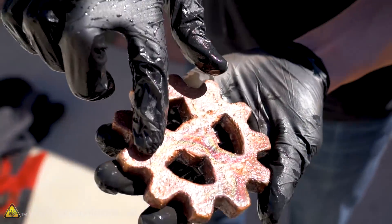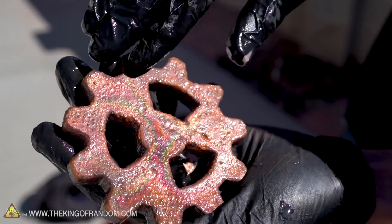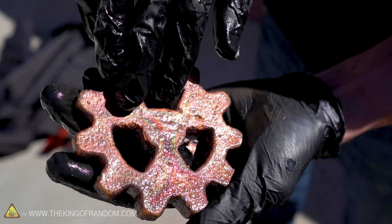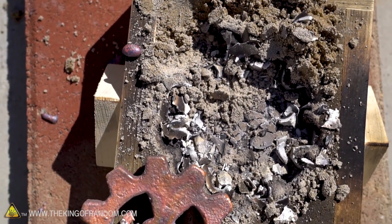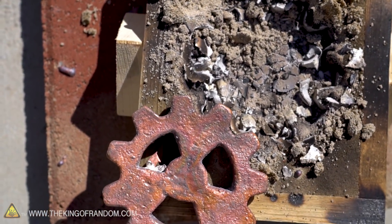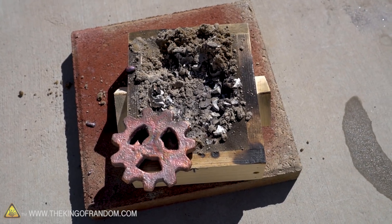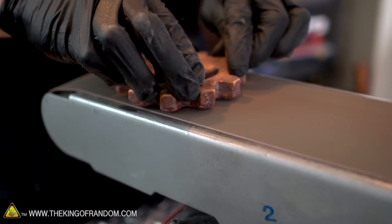There's an interesting sort of iridescent effect going on on the surface of the copper here. I don't know if that's from the copper itself, if that's from some contaminants that were in our crucible, or if that's from the shell material - but it looks pretty cool. This worked out pretty well - that drywall texturing paste did a very good job of creating a barrier between the copper and the sand, and we just had one little spillover point on top that had nothing to do with the sand getting into the mold - I just added the tiniest bit too much copper. Overall this worked really well. Very happy with how it turned out. Tune in for our next video where we'll clean up this copper gear and hopefully make it a nice shiny almost mirrored surface in places. That should look awesome.